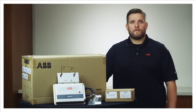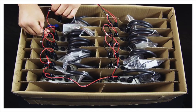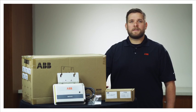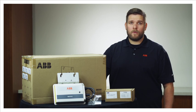Unplug all the input connectors from the micro-inverter and replace the blue connector caps. Congratulations! You have acquired the ABB micro-inverters using the CDD. It is now time to install the ABB micro-inverters on the roof. Please see our ABB micro-installation video. My name is Cameron Stewart. I hope this review of the pre-installation kit for the CDD was helpful. For more help, call technical support or visit our website to schedule an ABB PV Academy training.